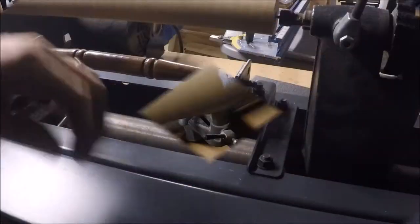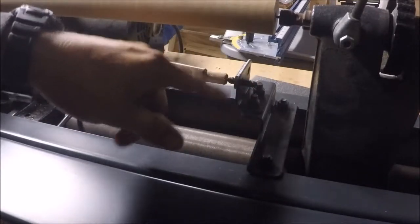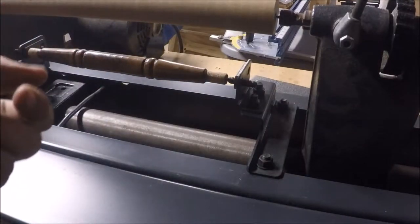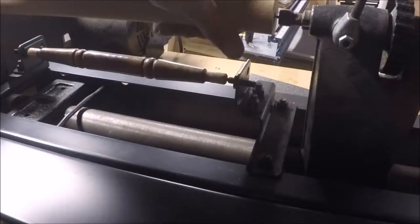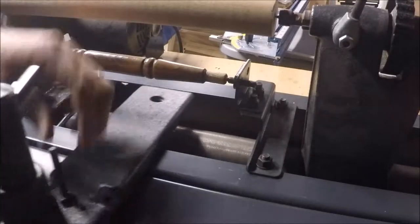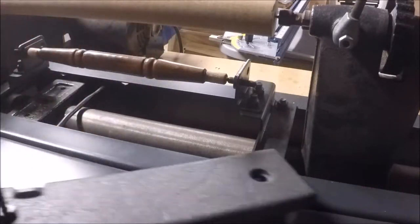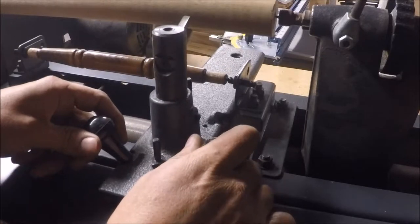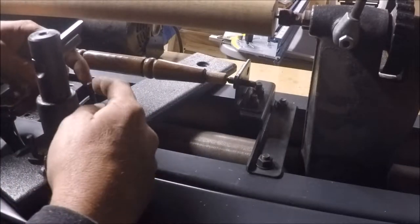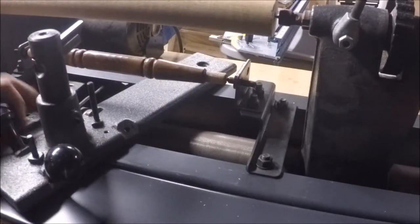I got this set up right now. I had to put this in the press and compress it and then run a tap through it because it wasn't lined up. I got my wood mounted — not really true on center, I didn't do a good job of finding the center. But there's this little pin right here, and this is the cutter. The pin kind of rides against the cutter and once it hits that it will stop. The problem is that pin isn't going to allow me to get the really deep grooves — the finer detail — so I'm going to have to go through and finish that up the old-fashioned way.